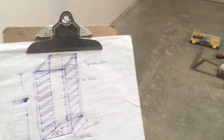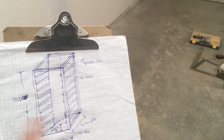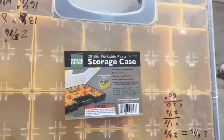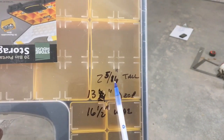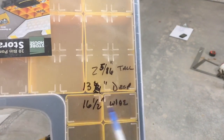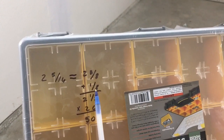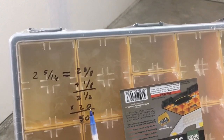So we'll be 19 inches total overall width. These are the storage boxes from Harbor Freight — I'll put a link in the description. When I measured the box out it comes out pretty close to what they describe on the label: two and five-sixteenths inches tall, 13 inches deep, 16 and a half inches wide. For height we'll round up to two and three-eighths to leave a little room, then add an eighth inch for the piece of angle iron it's riding on, which gets us to two and a half inches per space. We want 20 spaces, which means we need 50 inches.